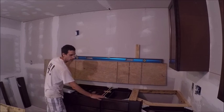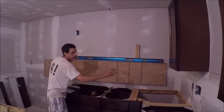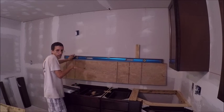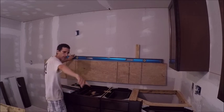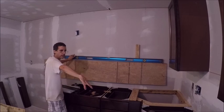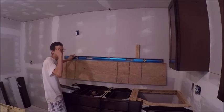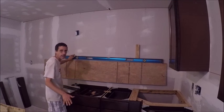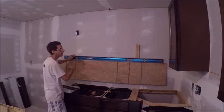Same thing happens with these lowers. If you take one of these lower cabinets and it's turned a little bit and you're trying to keep these things level, you end up going uphill. And we actually did it on this one here a little bit, but it was to keep it level across these 2 cabinets right here. And this house was built in 1950 something, 60, I don't know. The floor, even after we got the floor as level as we could, still goes down about 3/8 of an inch between that side over there and the other side over here.